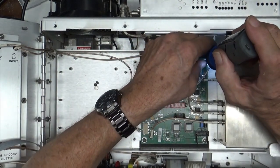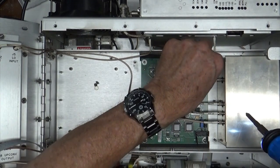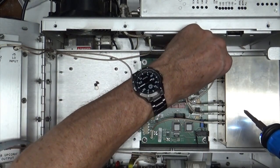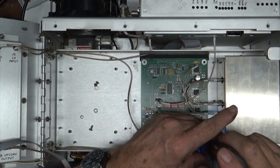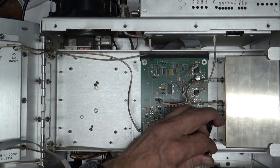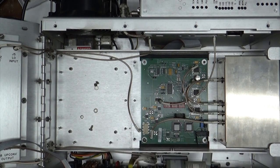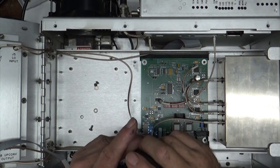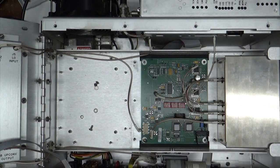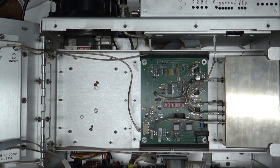I used to have to hire guys as technicians coming out of these technical schools. One of them's no longer around. I'm not going to mention the name. But I would give them little tests. And one of the tests was I would lift the emitter resistor on a transistor, just a standard NPN configuration, lift the emitter resistor so you couldn't see it, and see how long it took them to track down why the amplifier didn't work, usually just a simple little amplifier. And they would go through all kinds of little gyrations trying to figure out what was wrong with this thing.